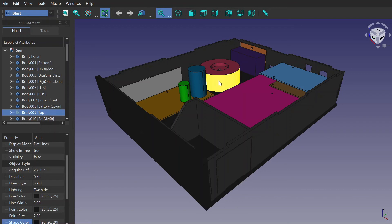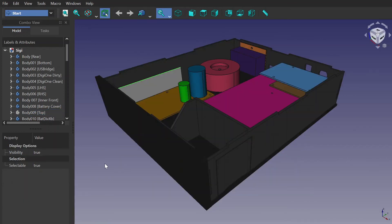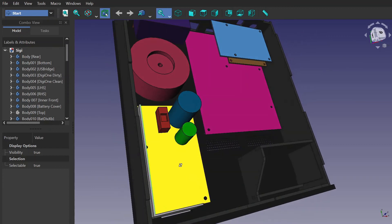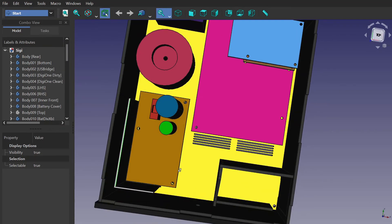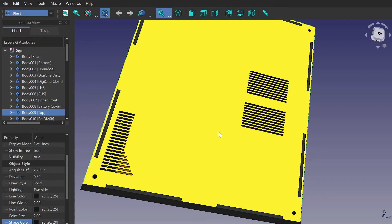Here we have a toroidal transformer providing the low voltage AC supply to the power supply board. The large primary smoothing cap, fuse holder, etc., are shown here — drawn to ensure correct sizing and fitting inside the box. Along the back of the power supply is a heat sink made of aluminium. With that drawn in place, it allows me to position the air vents underneath to allow adequate airflow over that heat sink. There are also air entry points over by the USB bridge, visible in the highlighted base. The top panel has air vents for the power supply and over the processor — these are the parts that generate most heat, but in reality it runs quite cool, so the vents are perhaps excessive.